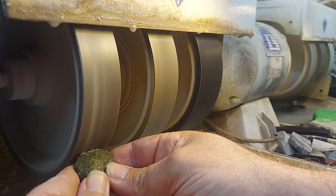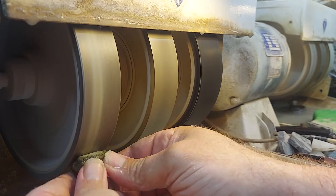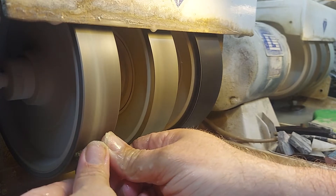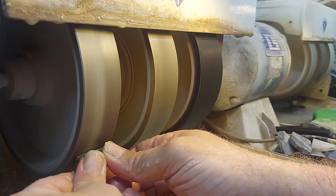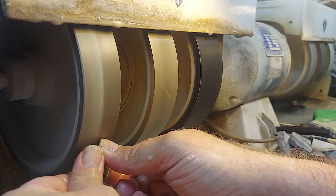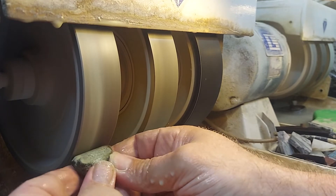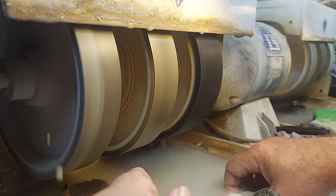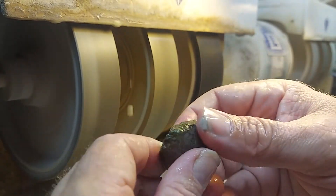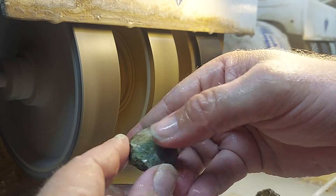What we're going to do on this is just polish the face. A little mud on the wheel here. So I'm using 80 grit. 80 grit is enough to knock it down nice and smooth on one side from what it was rough on the other. So we're going to leave it smooth here and rough there, and we're just going to belt it all the way across.